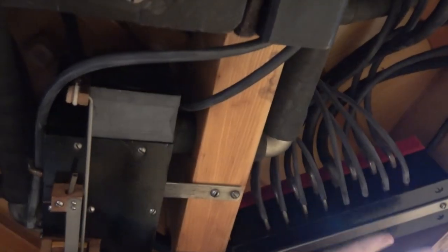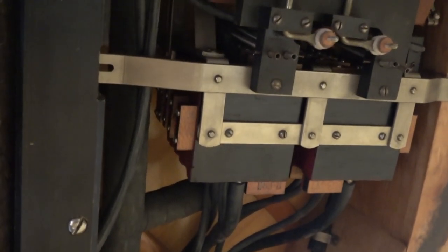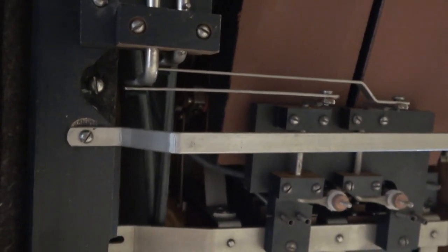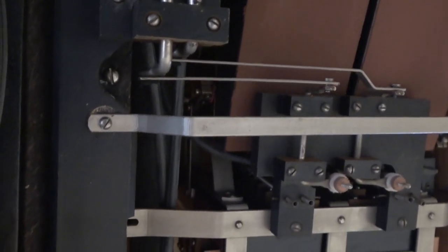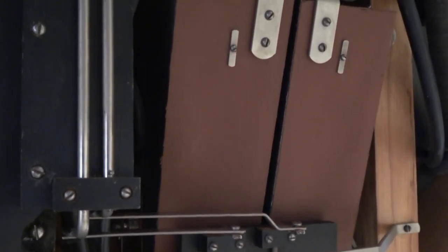And then there's a valve, and that amplifies the signal, let's say, and then it sends vacuum to these pneumatics, the accordion pneumatics that collapse and pull a lever, basically. And these are the levers that come from those manual overrides that you can control. They basically act on the same valves, and they do the same thing as the automatic expression.